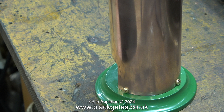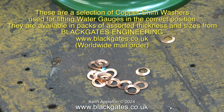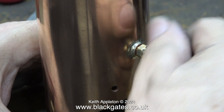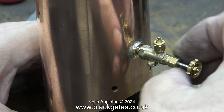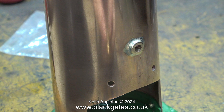With the boiler secured to the base, it's time to fit the water gauge. These are a selection of copper shim washers used for fitting water gauges in the correct position. They are available in packs of assorted thickness and sizes from Black Gates Engineering. I always use these when fitting water gauges — these are very small ones with an internal diameter of only 3/16ths of an inch, but they're available in most model engineering sizes. I've selected the thinnest shim washer from the pack, done a dummy run to confirm it fits perfectly, and now I'm going to fit it in place using some Loctite 542.